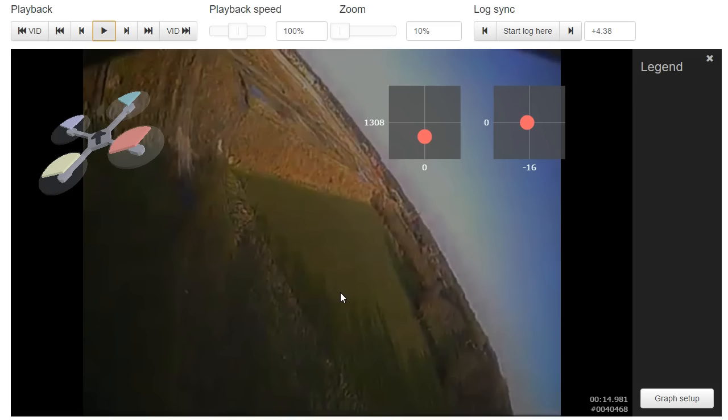Whenever I see something like that, that's not the first place my mind goes. So then, what could it be? One of the things it could be is excess noise coming out of the gyro. The noise gets to a point where the PID loop responds to it, and it results in these kind of weird random twitches because the noise is kind of random and it's happening too fast for the PID loop to really compensate for it. Maybe that will be less true at 4 kilohertz or 8 kilohertz. Maybe the PID loop will just respond to it and everything will be amazing. I don't know, but for right now, it can't really respond to it fast enough, and so it results in these kind of random twitches.